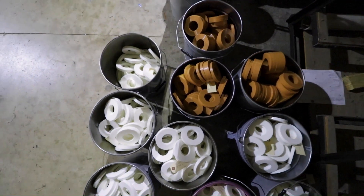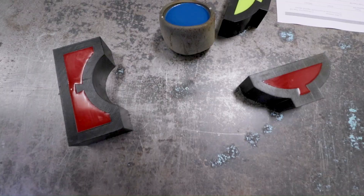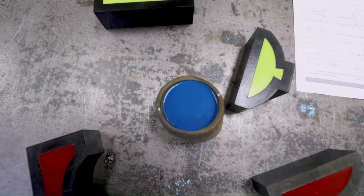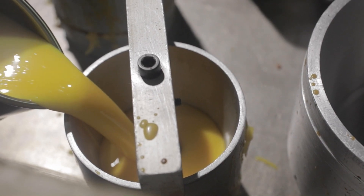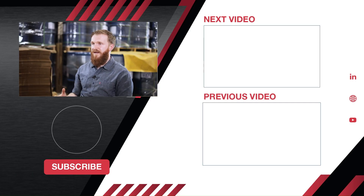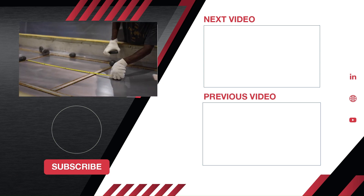There is not a large difference in what you're going to get from aluminum or 3D print casting, and that's actually a positive — because at the end of the day you can print a mold for a much lower cost and get the exact same part that you would out of an aluminum cast mold. A customer would come to us to have a 3D printed mold made for their part because of the 50 years of experience that we have with urethane and custom molding.